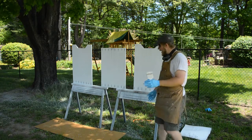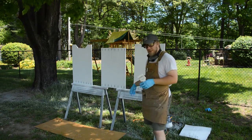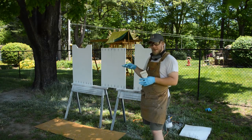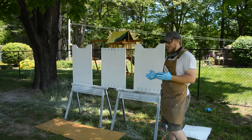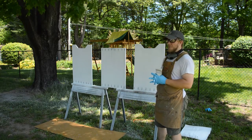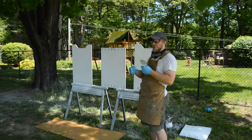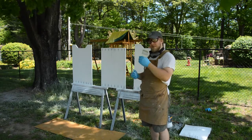I'm going to keep troubleshooting the paint sprayer, but in the meantime I'll try to coat the other two shelves. I'll take a little bit of the white paint, put it in, and test on my cardboard piece for nice clear coverage. My thought is the main chamber is getting gummed up somehow. I'm not going to over-thin — I don't want to put too much water in, but I don't want to go above or below what I had before, so I'll just add and test each time.